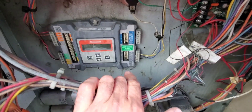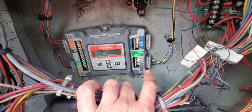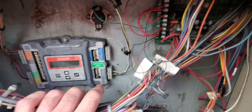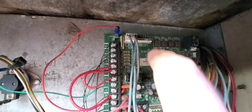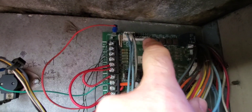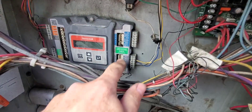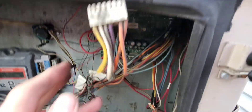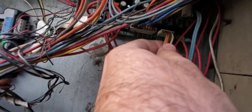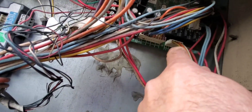Came over to the economizer. It said it had Y1 in, Y1 out. I checked that — it was power in, power out, and then up at the input here we pull this off. Up in here is econo in and econo out. So we had power going out to the economizer, leaving the economizer, and back in up here. Down here are the outputs: C1, C2, fan, and condenser fan.